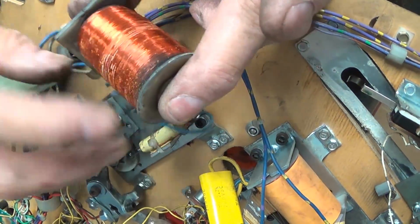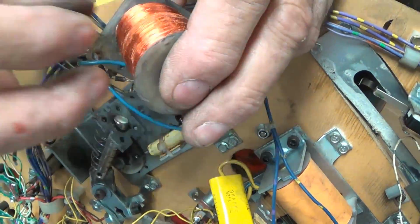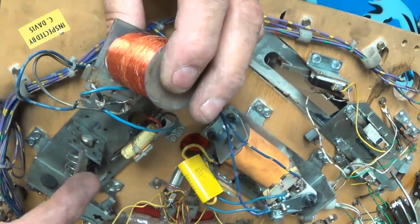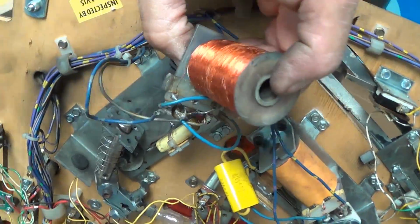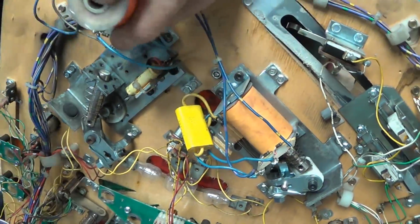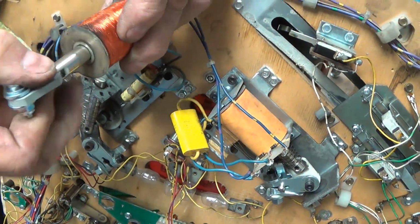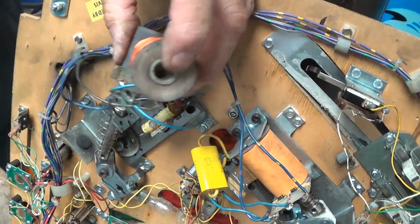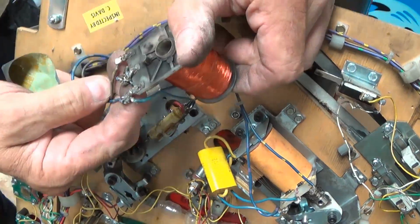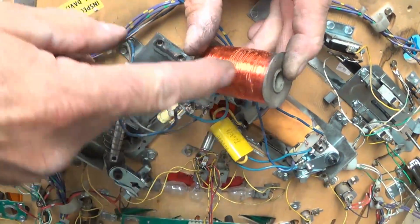When these get exercised through use, they contract and expand, and then that shrinks against this. And if this shrinks enough, the armature will not go in the sleeve very free anymore. It'll bind because that is getting smaller. So you lose performance and power, and of course the coil health is based on this.